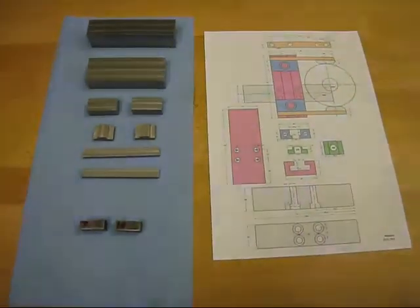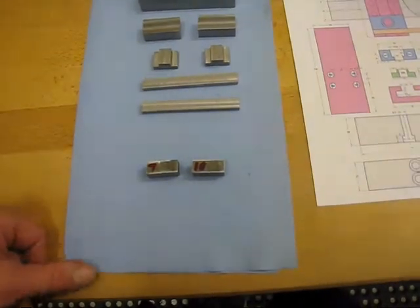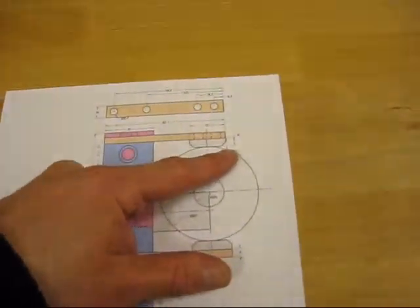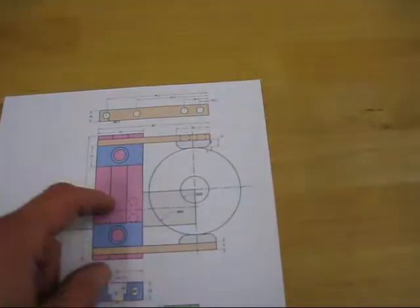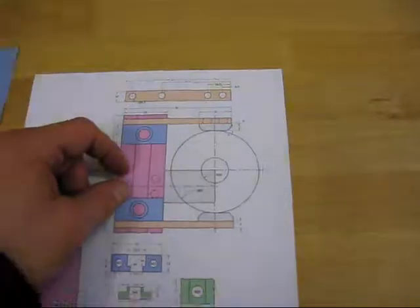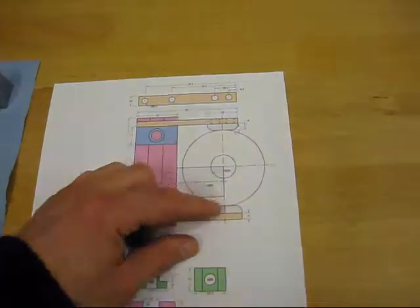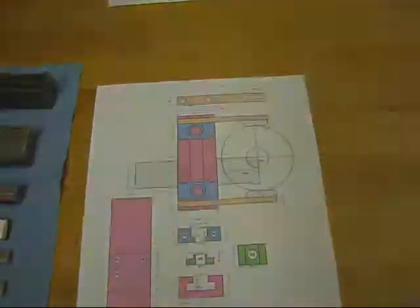I finished the outer shape on all the pieces except the pads. I'm going to do the pads after I assemble it and put it in the lathe, because that way I can adjust the thickness — it says 6 millimeters there. There's going to be serrations here, so if those holes don't match up perfectly with the center of the bar, if it's a little bit high or low, then I will adjust the height of the pads so it's just perfect. I think that's the best way of doing it.